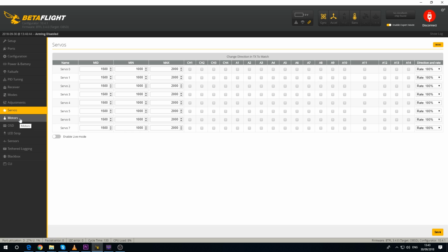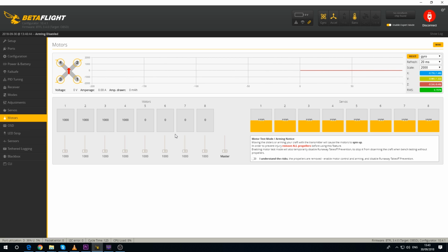Nothing in adjustments here. Motors, of course, I did have to test, so make sure all of your props are off, and then you can plug your battery in, tick this thing. Now, all of the motors were reversed. I think I mentioned it in the build video, so I'll link to the build video in the description below. But yeah, you want your motors going this way here, so you can just touch them. You can have them all going at the same time if you like, and then just tap them and see which way they are going, or you can individually move them. And I had to reverse every single one of them, and I'll show you how to do that in BL Heli Suite.